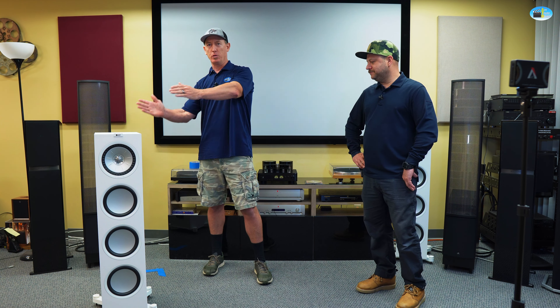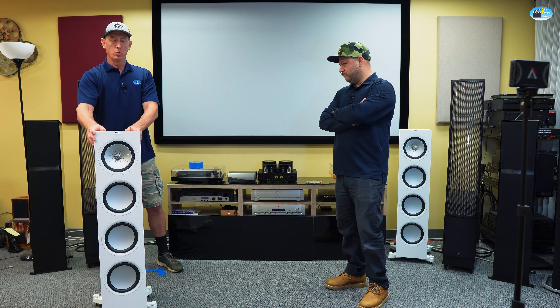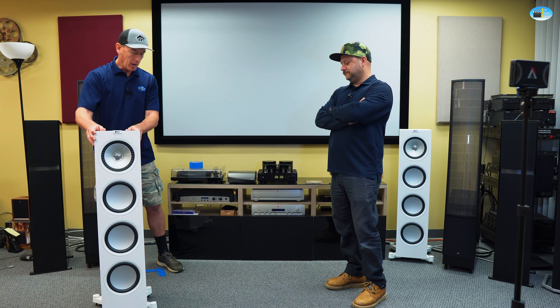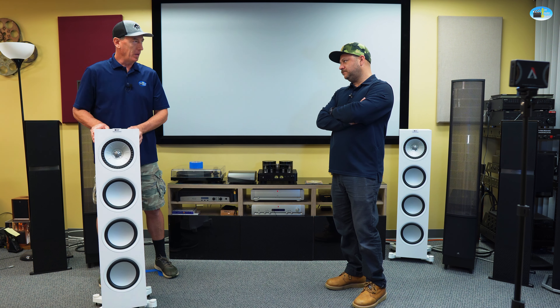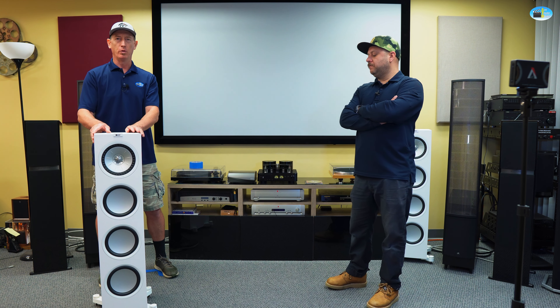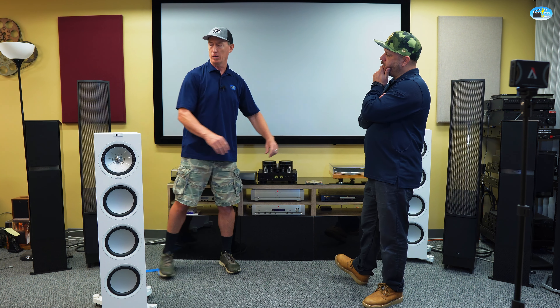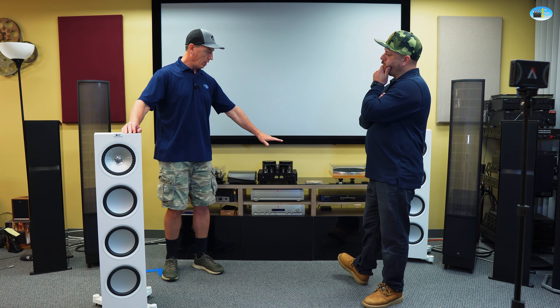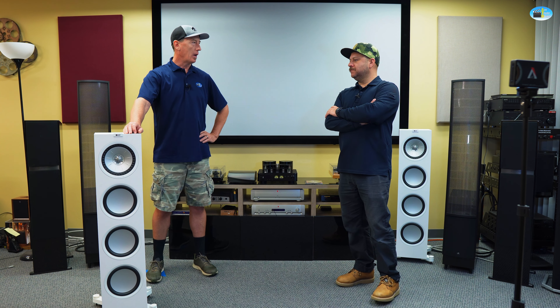The third thing that isn't really well known is adjusting your rake angle. The rake angle is when you tilt the speaker forward or backward. Be careful — if your speakers have spikes, doing this on a wood floor means you'll be punching holes in it. The idea is this: in the first step we found our center image and made two boxes magically produce vocals right in the middle. But that image might have the vocals sounding like they're coming from only two feet high.